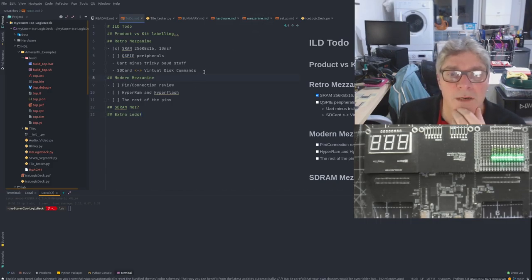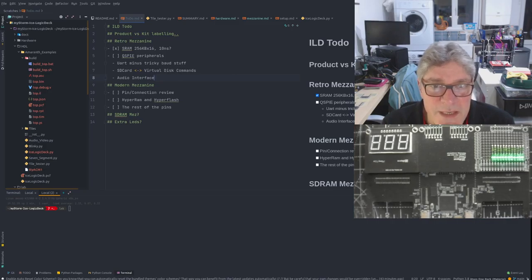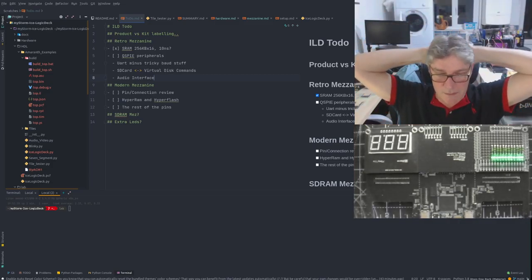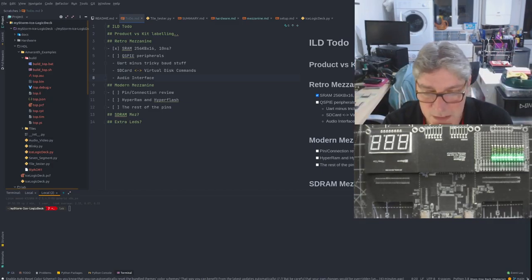So what else did we have on the list for QSPI? One of the things I was thinking of as possible is an audio interface. So the STM32 handled the audio I/O, whether that's digital or analog. Then there'd be a digital buffer over QSPI for the audio. That would make implementing the audio on the HDL side a little easier.